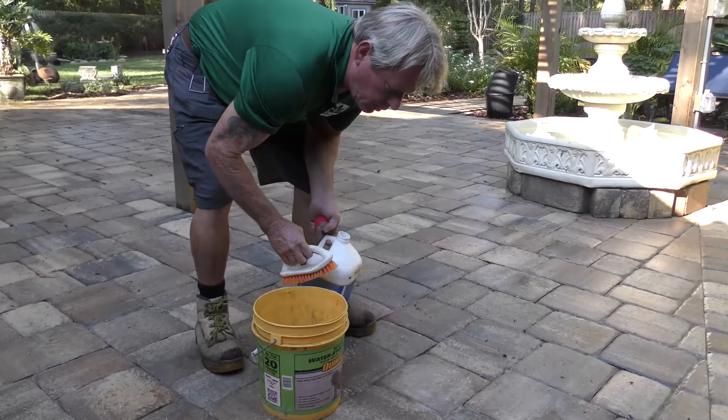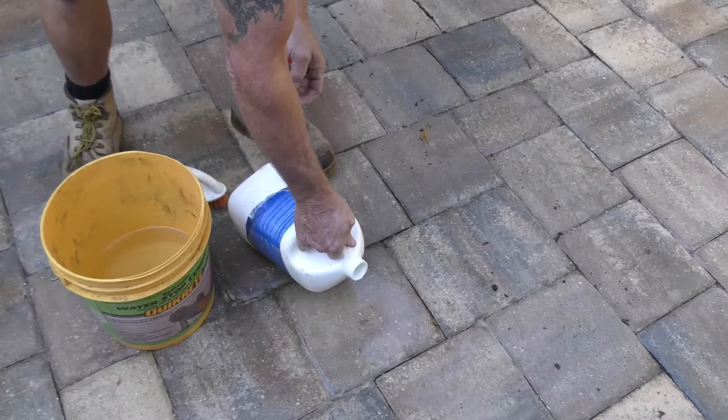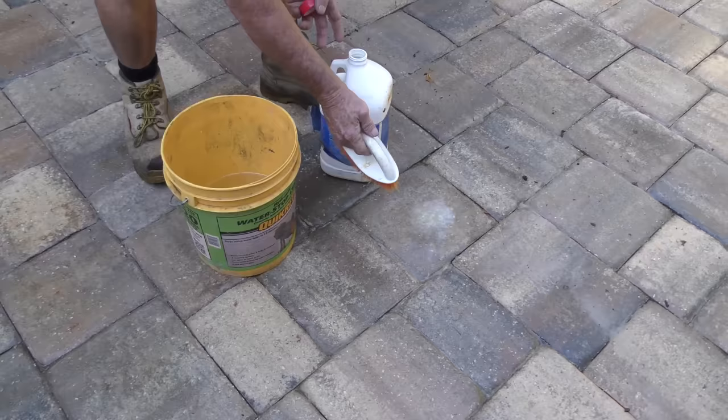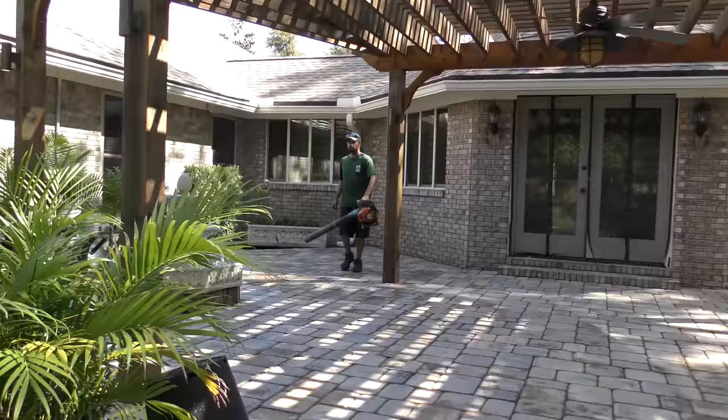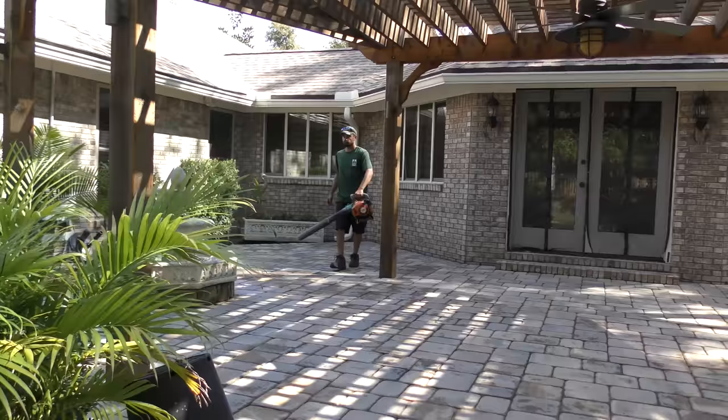You can see it's not exactly doing what I want it to, because I want this to be almost instant. So I do just a little splash of straight muriatic acid on it. That generally lifts that stain right out. A little agitation just to make sure. Voila.